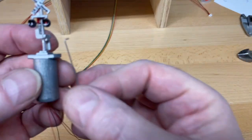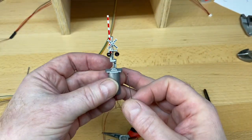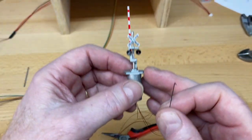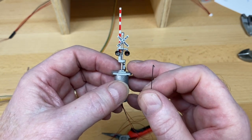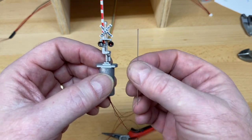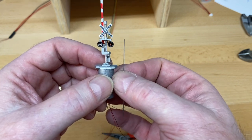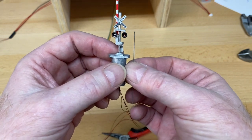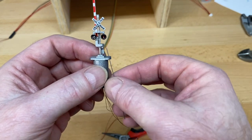As a result of that, we're going to have everyone bend their own metal. The other thing that we discovered, even though we have this set up with a 1-inch pad, is that each of the gates is just a fraction slightly different in height, and one size actuator arm, this little piano wire, didn't quite work. So we will put one in the box, but it'll be a little bit off possibly, and so we're going to give you a couple of extra of these metal wires. You can bend them yourself and put them up here.